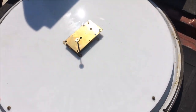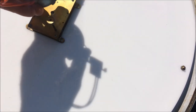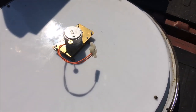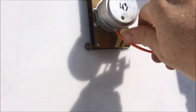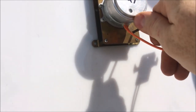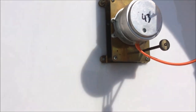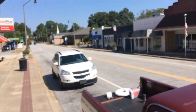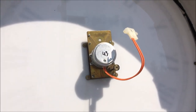We're back out at the clock, took the face back off, and got our new motor with the Molex plug on it. Took the screws out and it fits in - like a glove. Screwing it down now, then I'll do the ones on the other face up top. Got the new one mounted and when you turn the little knob the hands are moving, so it's engaged with the gears correctly. We're going to plug it in and set this face using the clock down the street, which says 11:56, and then let it sit all day to make sure it's keeping good time.